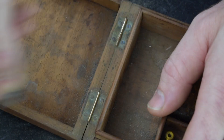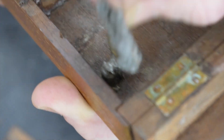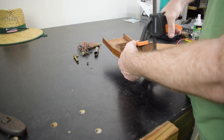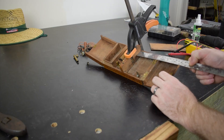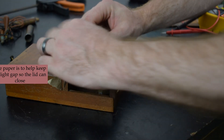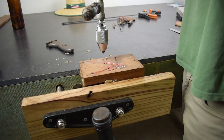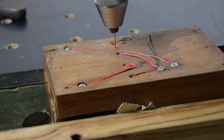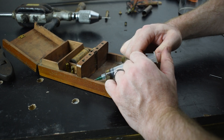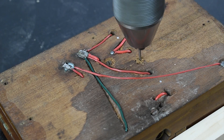I figured I'd have a look at some of the other parts as well. This middle section will be glued with hide glue. If anyone in the future decides to change or take it back to how it was before I started, they should be able to do so easily. I'm drilling some holes so that I can use nails to help align the parts when the glue is in place. I also decided to add a brass wood screw just for good measure.